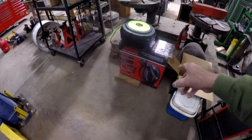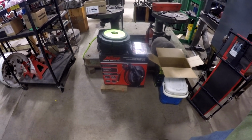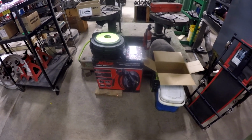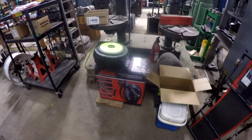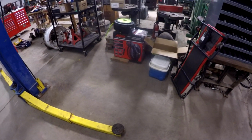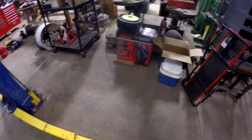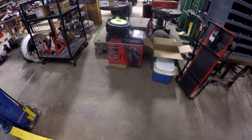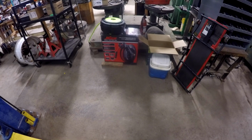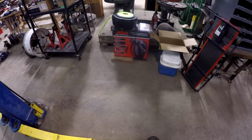The reason I have the 1/2-inch hose reel is I have a 3/4-inch impact and might be picking up a 1-inch impact at some point in time. But my air supply is being choked down by the smaller hoses and the restricted volume coming out of that Ingersoll Rand compressor. It's only a half inch outlet on it, and I think it's 3/8 hose that it's coming through, but it's choked down to, I think, quarter actually with the fittings.